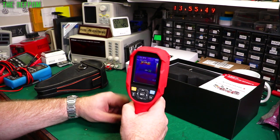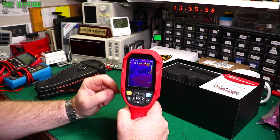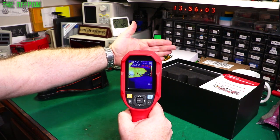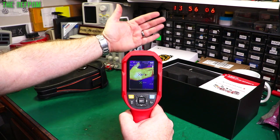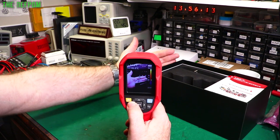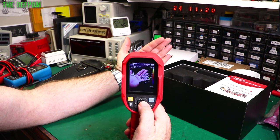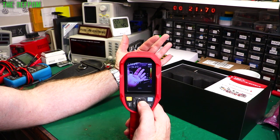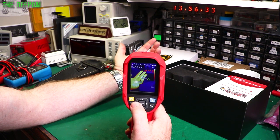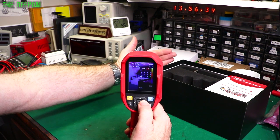This can actually focus as close as 25 centimeters. You can adjust it in steps of 25 up to a certain point, then it's infinity for the camera alignment. You've got both a thermal camera and a visible light camera, and you can actually mix them. Scrolling back, there's the visible camera — normal visible light. It's higher resolution than the thermal. You can filter it all the way through to fully thermal, and it tells you the ratio you're in at the bottom of the screen.